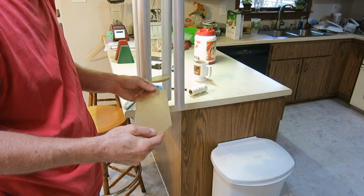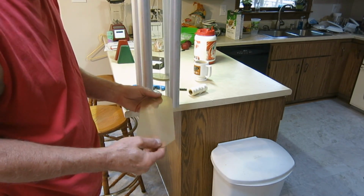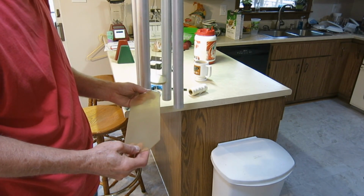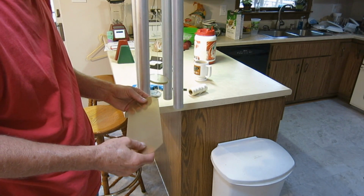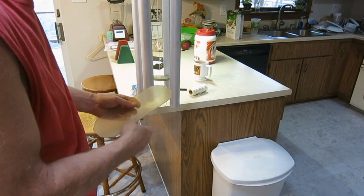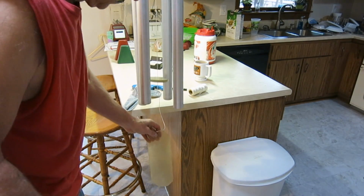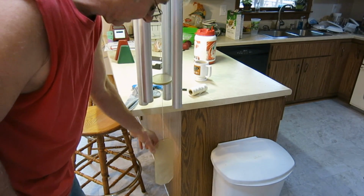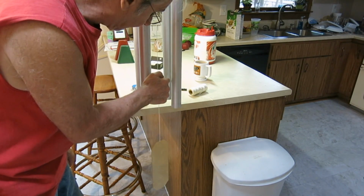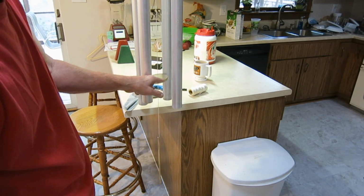I've used plexiglass. I've used polycarbonate. Any junk you can find. I've used stainless steel. I've used aluminum, 16 gauge aluminum. And you can pick any kind of a pattern, any kind of a shape. You can put your initials on there. You can put anything you want on the bottom of here as a wind catcher. That's your wind catcher. Like I say, the longer you bring that down, the less wind it takes to move. And it also has to do with how far apart your gap is whenever you make this round piece.